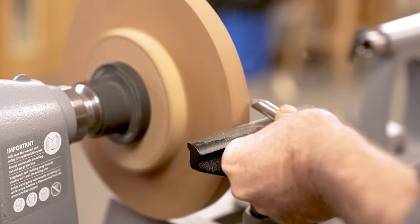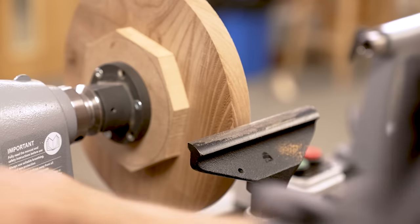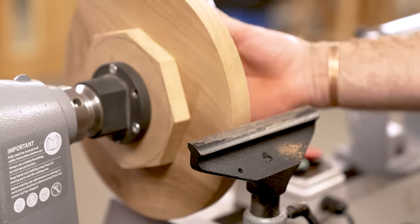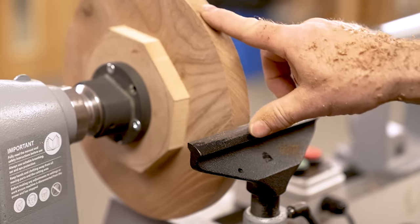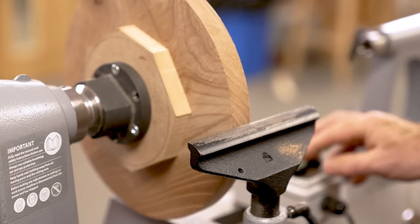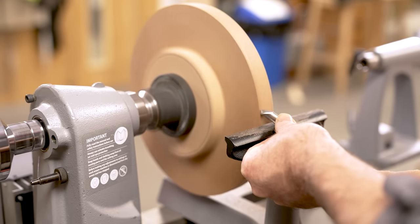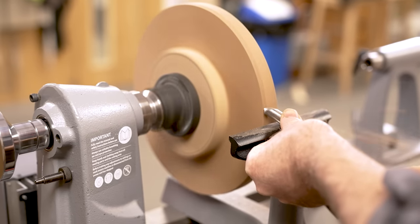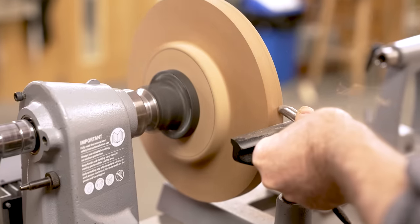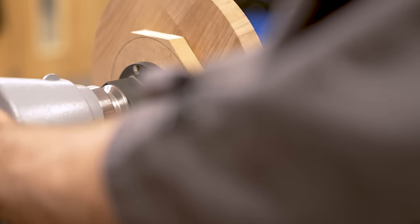That's better, hopefully, going to be round. Nice and clear, and we've got a little flat just there that we'll get there. I'm looking at the top face as well to check it looks square. So let's just do that last little bit. So rest on again. I can roll my wrist. There's our cut. Really nice, cleanly cut. No tear out.